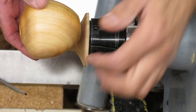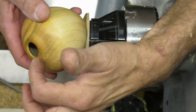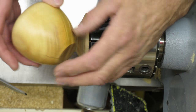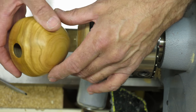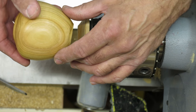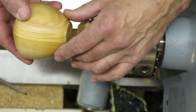Here's the finished hollow form. It's about three and a quarter inches high by about three inches across at its widest point. The entry hole is just under three quarters of an inch and the wall thickness from the entry hole down to about here is just over an eighth of an inch. I left it a bit thicker down the bottom because of the cracking there. I'm very pleased with how it's come out — it looks rather nice with nice figuring on the cherry. The Simon Hope mini hollowing set did itself proud and was a pleasure to use. I'll put links below to both Sam Angelo, the Wyoming Woodturner, for the inspiration on getting involved in hollow forms, and to Simon's website as well. Thank you very much for watching, don't forget to subscribe, and I'll see you very soon. Cheers now.